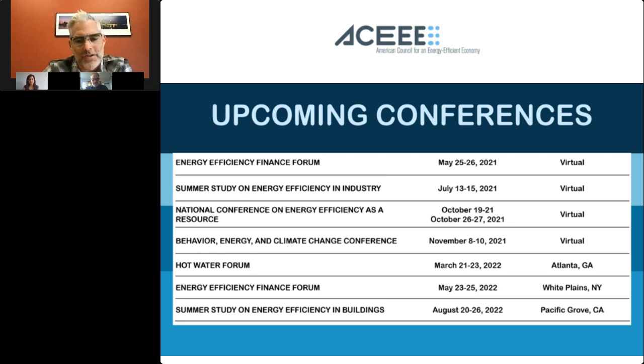For the Shower Start technology, it's been out for, gosh, probably 10 years now, and there have been a number of field studies. Essentially, we see that technology in single-family home applications, based on field studies, saving around a minute's worth of hot water from going down the drain for every shower. You can take that minute and multiply it times whatever flow rate that showerhead happens to be. The data we see is around a minute on the high end. On the lower end, it's probably closer to 40 seconds. So it's somewhere between 40 and 60 seconds, depending on the application, on average, that you're going to save for behavioral waste running down the drain.